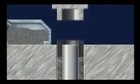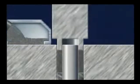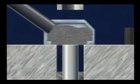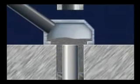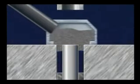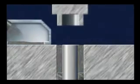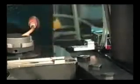If the part being made is thin and uniform in height, the powder can be pressed from one side by the upper punch. When that punch withdraws, a lower punch raises the part out of the die. The part is then ejected by the wiping action of the powder feed chute, which also wipes powder for the next piece into the die. Ejection from the press can also be accomplished using automated handling equipment.